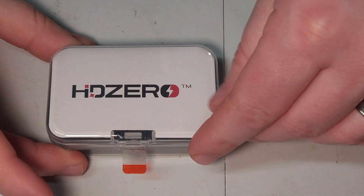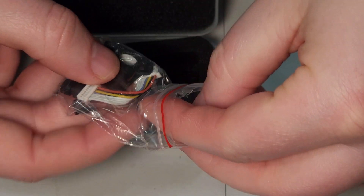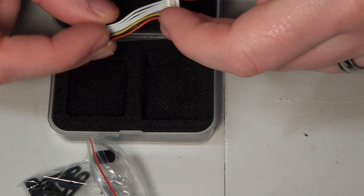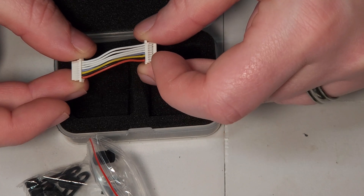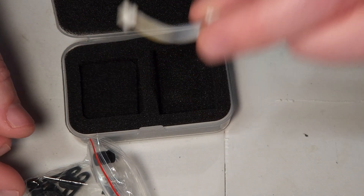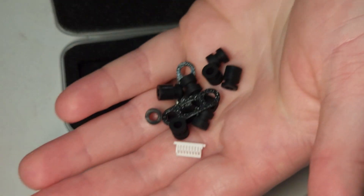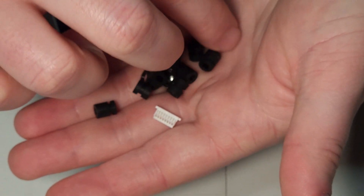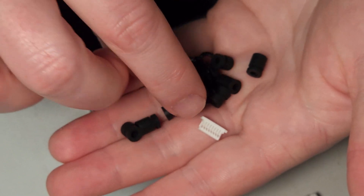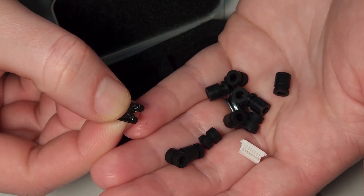Let's take a look at what comes in the box. You've got gummies and a cable for your ESC. Do note that this cable pinout is probably not going to match your ESC. This is the new Betaflight standard cable pinout, and you'll need to repin it to match the ESC you're combining this flight controller with, most likely. Please pay attention to that or you could nuke it. There are also two heights of gummies — I always opt for the smallest one. There's also a piece to restrain the ExpressLRS antenna: you fold it over and put the antenna wire through the fold.